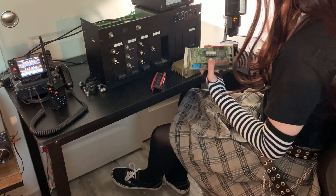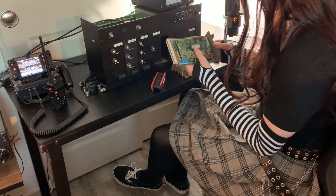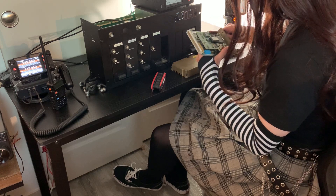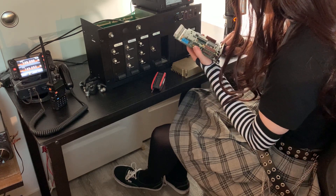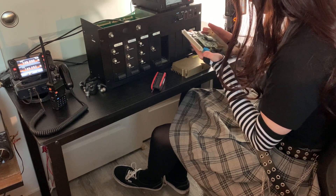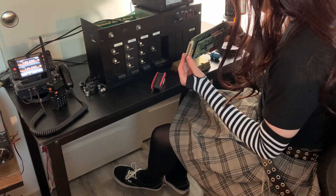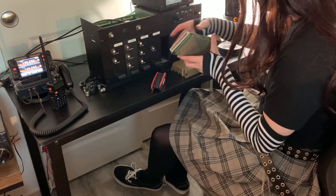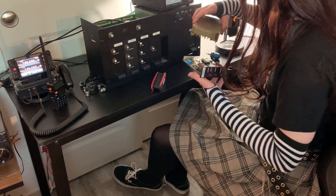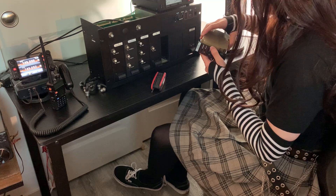Here's the control module — it's pretty much what you'd expect. This is actually a model from 1992, which is kind of new, but it's basically just your standard old 8051-style system. It's two boards, and there's an EEPROM in here as well — it holds the settings — and the clock crystal is in there too. My board is a little crooked for some reason. Anyway, this box is a really good RF shielding job and you can see it has all these notches on it.